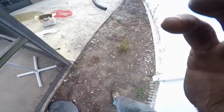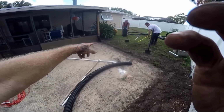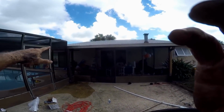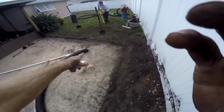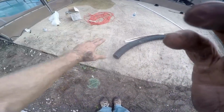So now we've got solid pipe coming from this downspout over here, picks up that roof. All of that roof comes down, comes through that downspout. We've added that line. We also added a catch basin here because this patio slopes so dramatically this direction and water's getting trapped here as well. So that picks up more surface water over to the pump.